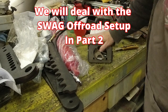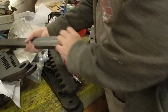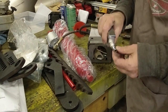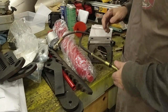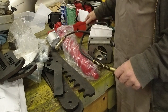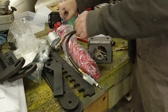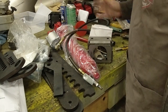What we've got here is a Swag Off-Road conversion kit designed to change this over from using this great big lever to wrench the pipe bender or tubing bender. Instead, we're going to use this air over hydraulic — this plugs into an air fitting of some sort, and we just use the trigger. This piston essentially does the pumping rather than having to do it with the hand jack. This will allow us to just set it on a bench, mount up what we want in it, hit a button, and it will bend. It will be much easier to work with.